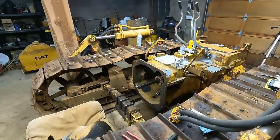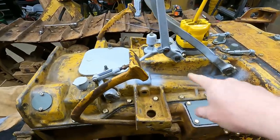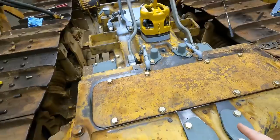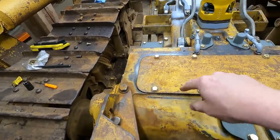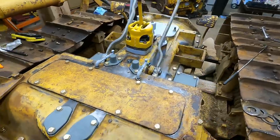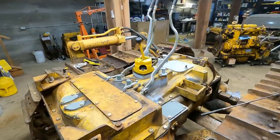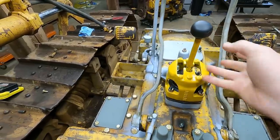Over on the transmission case cover, off camera this week I torqued everything down to spec. I ran RTV over all these panels that need to be sealed and torqued all that stuff down. For the steering clutch cover and the main clutch cover I had a cork gasket that I made — Permatex number 3, then the cork gasket, then grease, then the cover. That way they need to come off occasionally but you don't want the cork to stick. I did rebuild the shifter on camera — basically all new parts — it's so much nicer than it was.